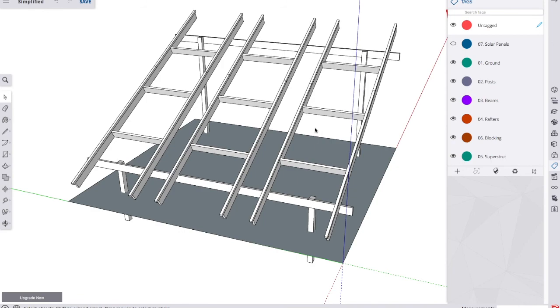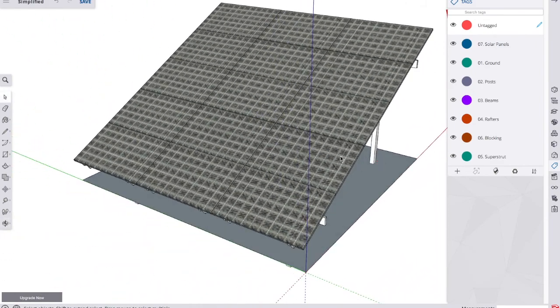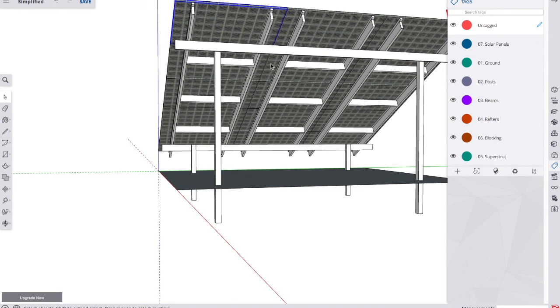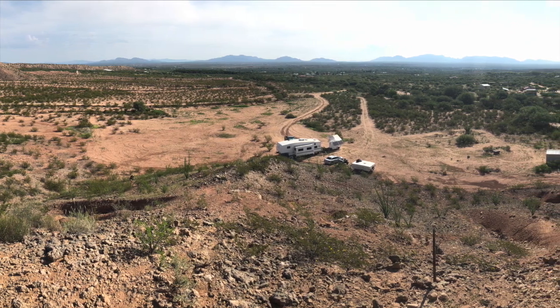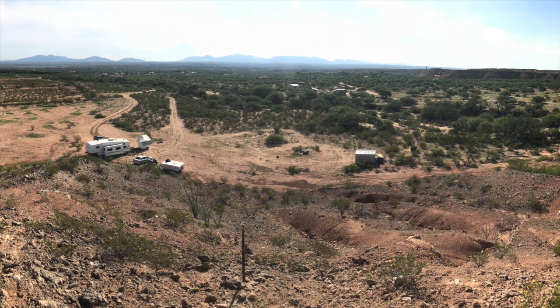After closing that down, I just realized I didn't show maybe the most important part — I didn't show you the panels on here. Just to give you the visual, there are the panels sitting on the structure. I've got them colored so the lines are a little hard to make out, but there's one, two, three, four, five — a column of five, three columns. They're all butted up pretty close but I'll leave a little gap with a small spacer between them. The back view shows how things go underground. I'll add a little more blocking and two braces in the back, but this gives me enough for my materials list to run to the store and hopefully get it all in one shot.